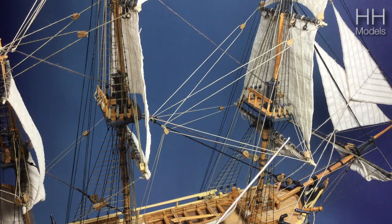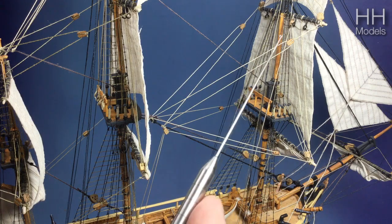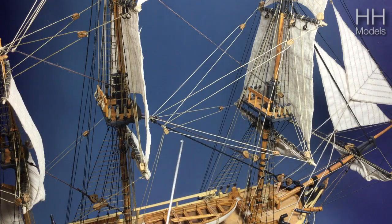Now, I've also worked further now and I have added these great big long lines here. And they also then have pulleys or blocks, if you want to call them, and they run down to the deck to the belay points down there. And these are the braces, and the braces allow you to pivot the yards for tacking so that you turn your yard against the wind however you want, and this allows you to basically sail against the wind